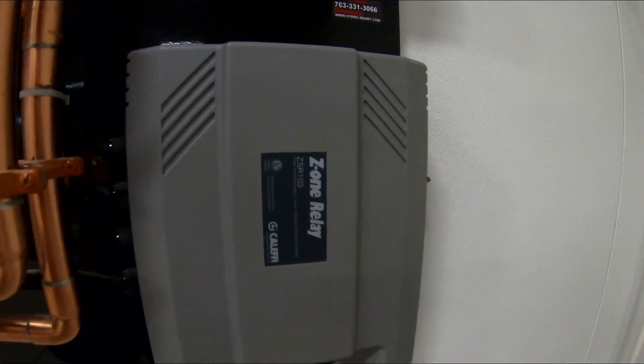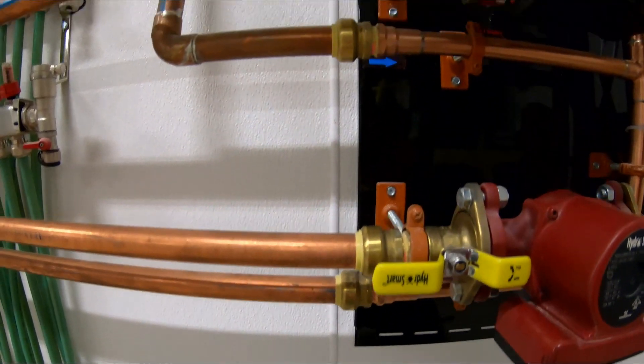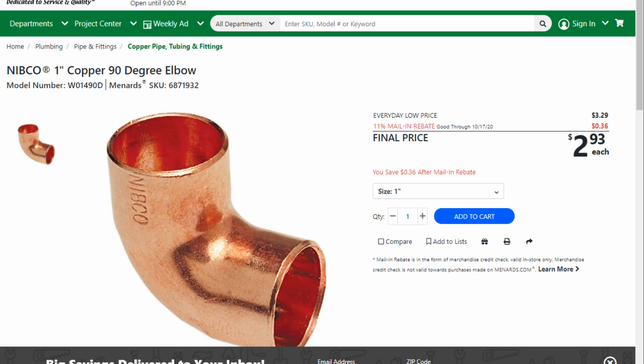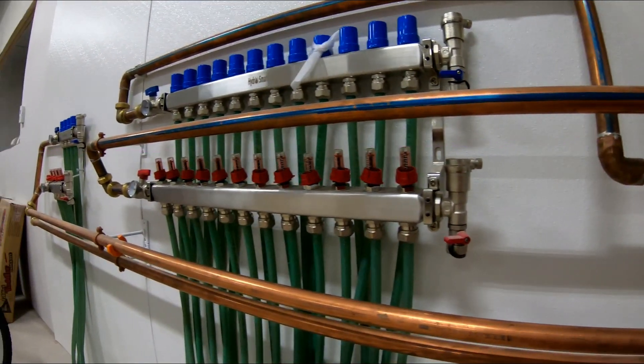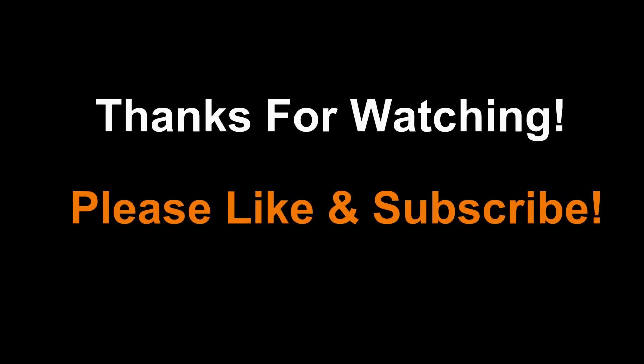The return just goes up pretty easy — it goes back to the pump. Your zone controller, depending on how many zones you have, just buy the correct one and then go back to your manifolds and you're done. Use type L copper with your fittings. Pretty easy if you're good at sweating it, and you can make it look perfect. It's not too hard. I wish someone would have shown me this so I could have made mine. Thanks for watching.